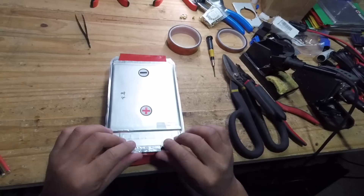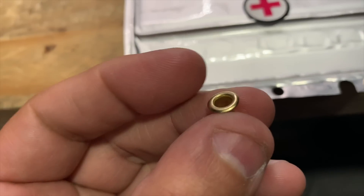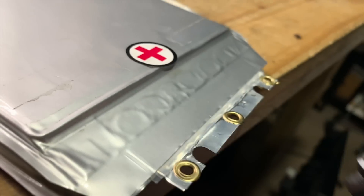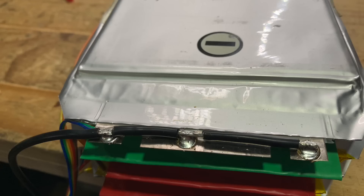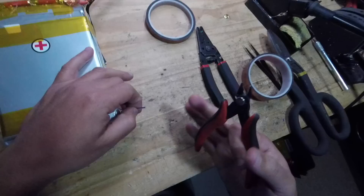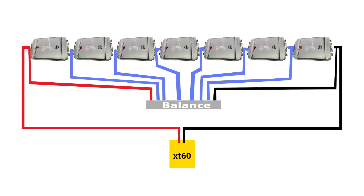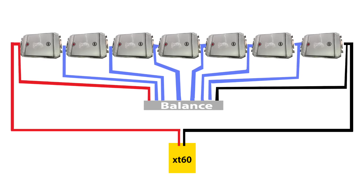These cells are particularly hard to connect into packs as they have aluminum tabs that cannot be soldered. So I'm using eyelets made out of brass, using a hole punch to make holes on the tabs and using the eyelets to connect two cells together. Then later, this can be used to solder leads and balance cables into it. We are basically arranging these like a typical lipo pack — seven cells in series with a balance lead into a balance connector. We are making six of them and finishing them with Kapton tape all around.